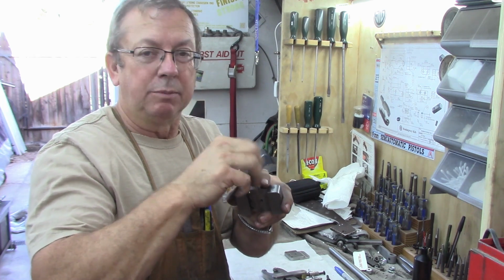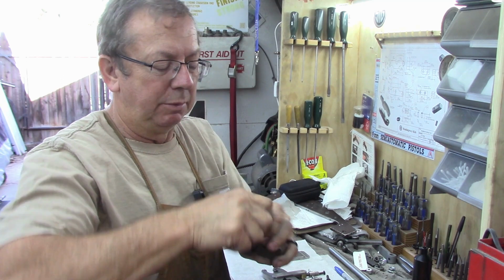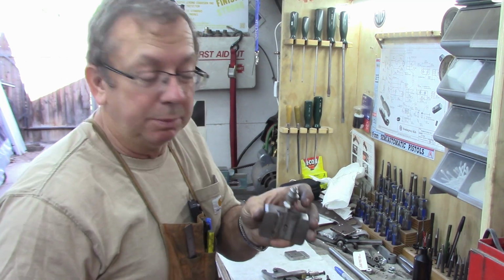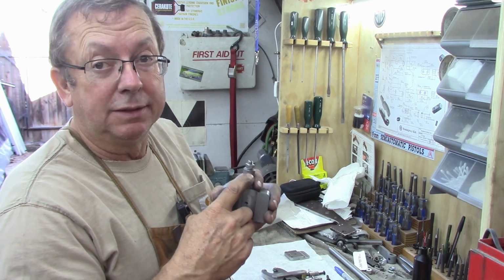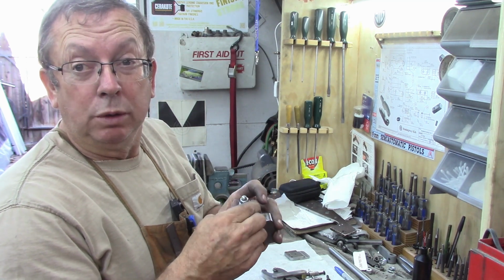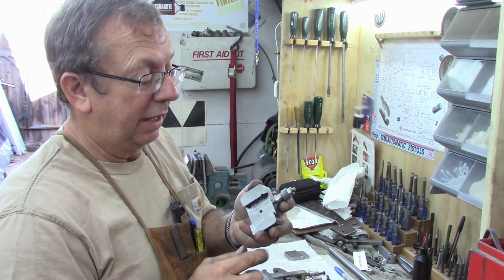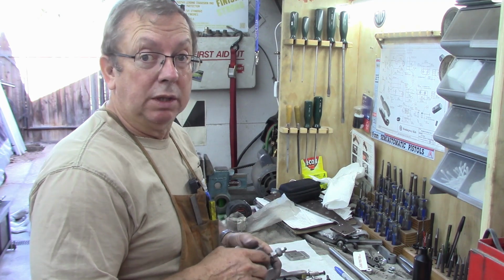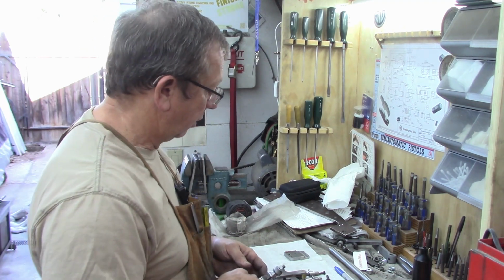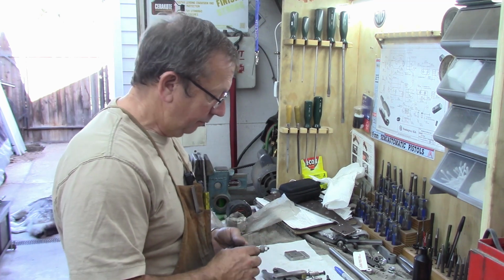I'll change that to something different, either a larger outer diameter nut probably will be just fine. That'll match most of the rest of the tool posts. Now, the only reason this has a diamond knurl on it is that's the only knurling tool I had set up that had a fine knurl on it. I could have messed around with the turret lathe tooling and probably got a straight knurl to match the rest, but later on we'll probably go back and do something there.